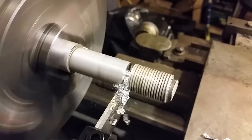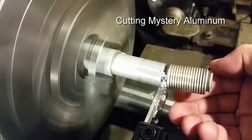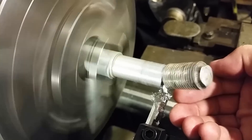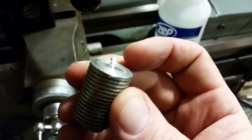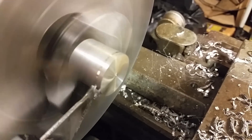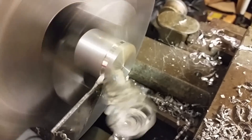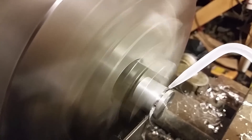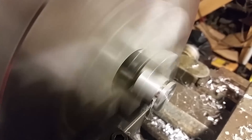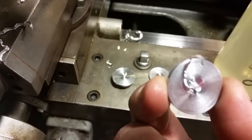Here's the first thing I've ever parted off. Stuck out way too far, but I'm just knocking these threads off to make something else. It's high speed steel. I got it ground at an angle trying to take this off and not leave a pip, but it didn't work out — left a huge pip. So I tried again with a chunk of table saw blade I cut out using an angle grinder, left one of the carbide teeth on there, and left the bevel grind intact. It cut really well, had no problem at all. If you push too hard it'll tend to wander a little bit, but if I made a flat cut it would solve that issue. It still left a pip, even with a finer or sharper grind. But it's cool to have the ability to make a parting blade out of a table saw blade.